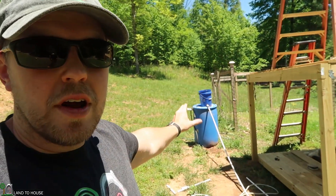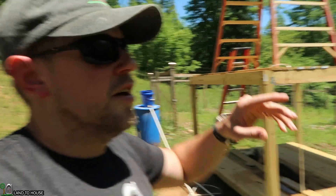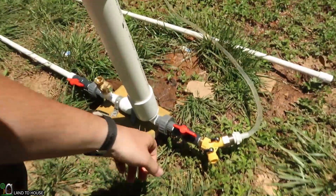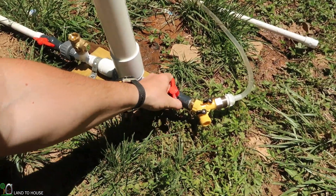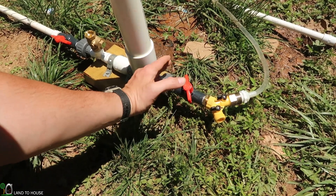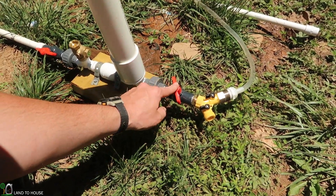You need to do a couple of things with that. First, lower your head pressure. Second, you could increase the height of your delivery — even adding a pole and just bringing your delivery pipe up another five to six feet can be enough. A third thing you can do, which is sometimes a little bit tricky, is to create friction by reducing the output size. So if you were to cut this valve by about 45 degrees, it would cause friction and allow you to pump to a lower height than what we were just doing.